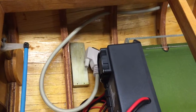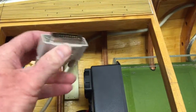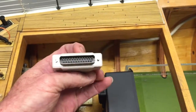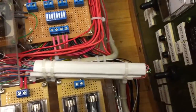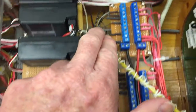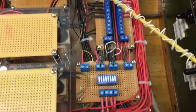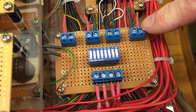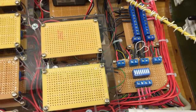The easiest way to get power to your superstructure is I use this 25-pin computer cable. There are 25 pins, so you can use one for your negative — that leaves you 24, giving you 24 functions that you can get power to. If you follow that down through the model, it comes down through the frames and pops up over here. The wires going into this white sleeve are wires I haven't used yet. The negative runs over here — the small one gets plugged in there. Some of the positives are going to run to your relays, and the two positives for the radars plug in here. Computer cables are an easy way to get all your functions hooked up at one time.